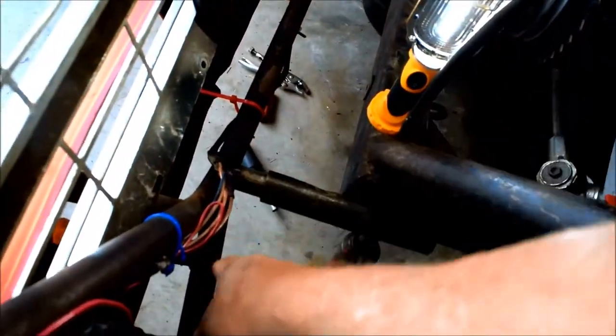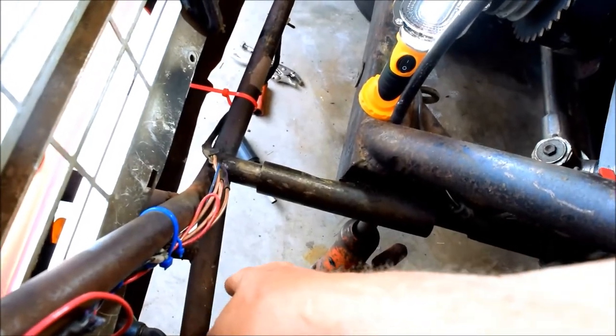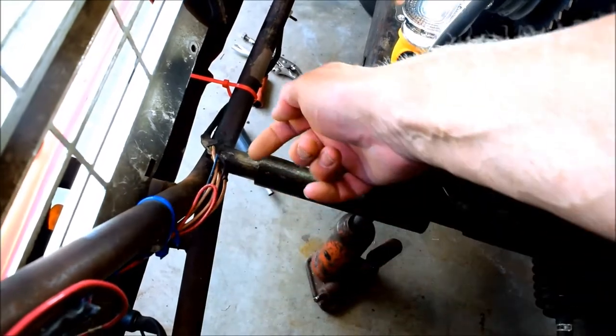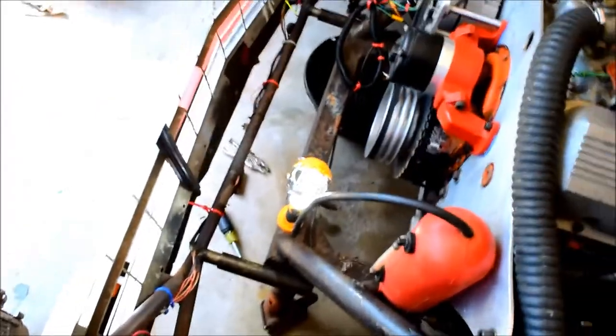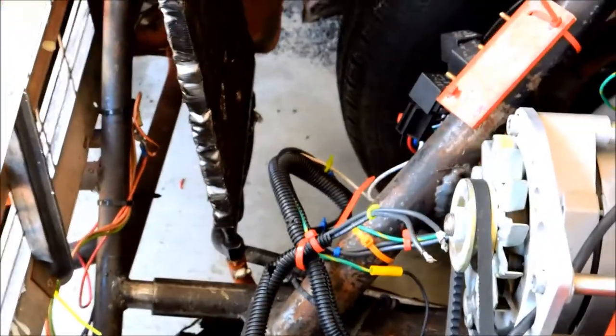From this point to here, the stub is going to have to come out and be welded here, or maybe up a little higher. So maybe some sort of a strut will have to come out to meet the new location, if you can follow that. And the same with the other side — same deal over there.